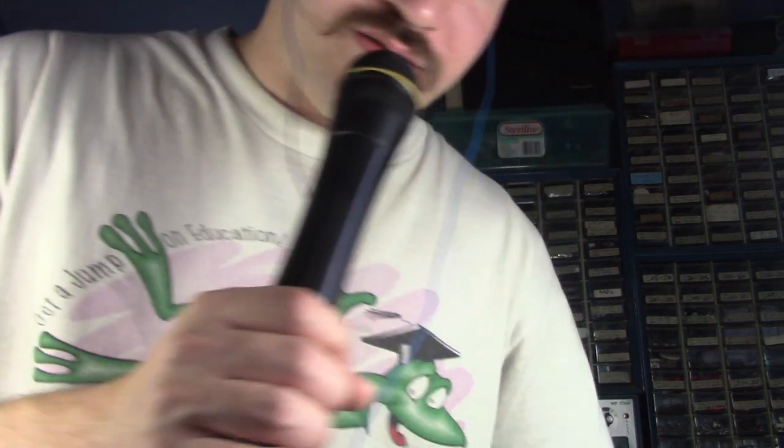Yeah, and anyway, this is an interesting recorder. It's very, very interestingly engineered, with lots of field effect transistors being used as electronic switches. There's no formal record-play switch in it, you know, the long switch you typically see in tape recorders to switch between play and record. The recording and playing switching is done by feeding a logic signal from the switch here to logic gates, and then sending it to FETs, turning parts of the circuit on, parts of the circuit off. It's very interesting how it's designed, although I don't know why the automatic level control couldn't have been done a little better. But it's quite interesting, this recorder.